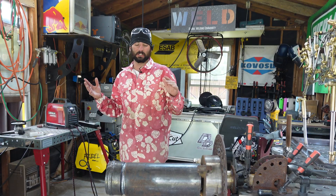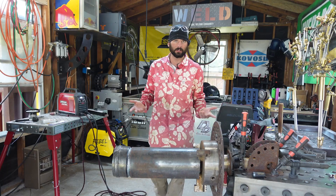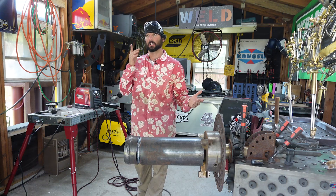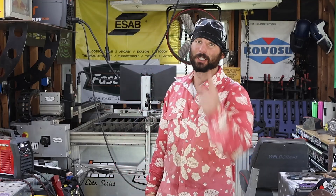I appreciate you guys for watching this episode. I had a fun time doing something more my speed as far as welding goes. If you're in school and you're working, you should really be focusing on your prep and your fit-up, making sure those are perfect because it makes your welds a lot easier. That being said, if you do prep and tack together a coupon and it's not perfect, weld it anyway — see what happens, at least put the bead in it. If you're in the field and you walk up on a weld like this, I would say no way — go ahead and call QC. See if he says it's okay, because you don't have to buy the weld. If it's a bad fit and something comes up bad against your record, you have the right to say something. Now if QC comes by, they would never buy this fit — nowhere I've ever worked would ever buy this fit. But if QC comes by and says 'hey, can you, will you?' — show them what daddy can do. We'll see you on the next weld.